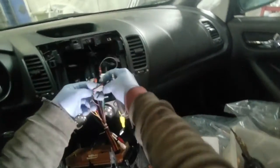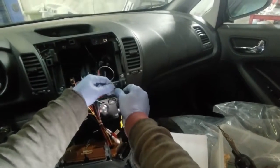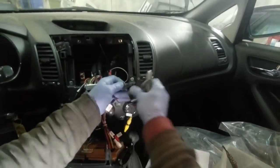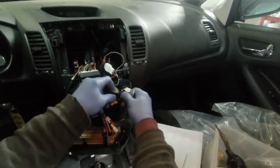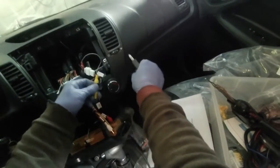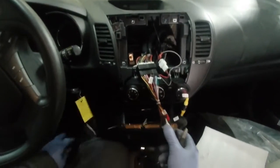This is the cutter — we cut the tape. Now I'll tape the ground. It doesn't matter much but I'll put something on it. We tape the ground — better to just cover it. We need to cover this cable by tape to be sure it doesn't get loose, because this is an analog signal coming from the back — you have to cover it so it doesn't get affected by power around it.